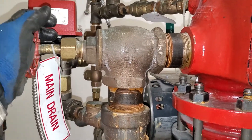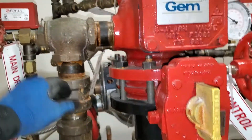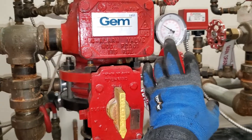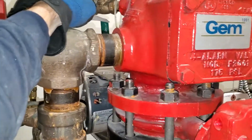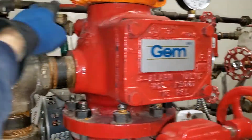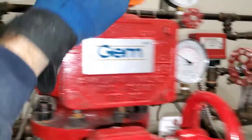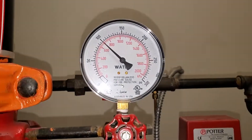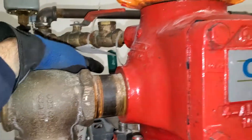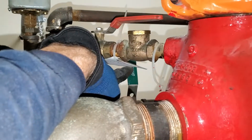And then I open the drain and reverse: close the drain, open the main shutoff valve, and when that pressure is built up and no more pressure is building, then I open the excess pressure pump, and I'm building up more pressure on top than on the bottom. And then, when everything is complete, I open the alarm line.